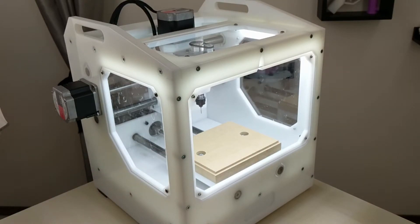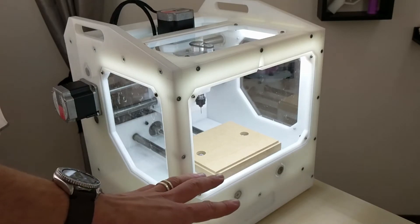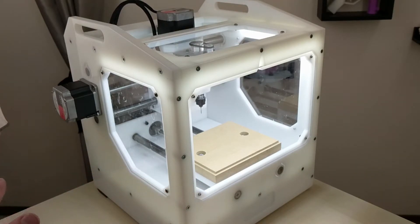The bed is just MDF because I've found that to be fairly easy. What I normally do to secure material — as you saw when I was milling the PCB — is I put a piece of masking tape down, squish it down really good with a steel spatula, a little bit of crazy glue, cyanoacrylate, another piece on the work I'm working with, and a little bit of accelerator on the piece I'm going to mount. I found that works far better than double-sided tape. Double-sided tape tends to release when it warms up, but the two-masking-tape-with-glue method doesn't release from heat. I've machined aluminum for hours on it and it stays really solid, and it doesn't goo around like double-sided tape does.